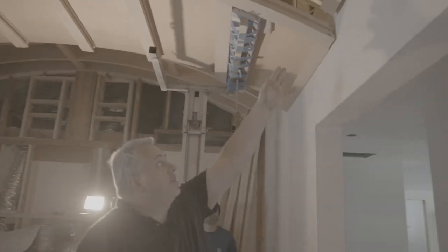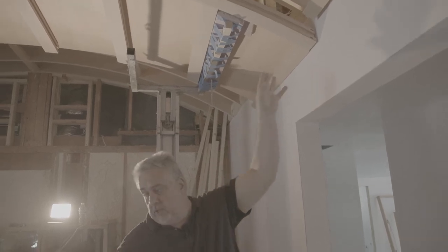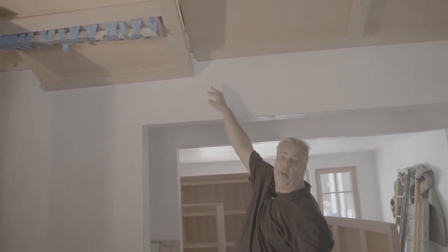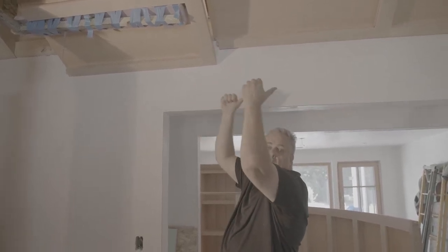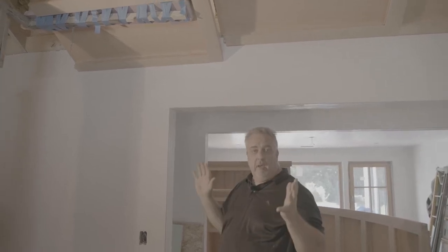You can see the series of what we call dominoes here. You can see how those dominoes are basically sticking out, and we have the two holes registered. This literally gets finished in place and then simply glued and pushed over and secured in place. And that's how we get this coffered ceiling installed.